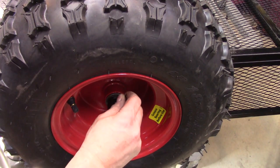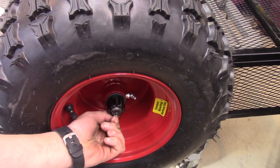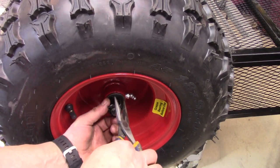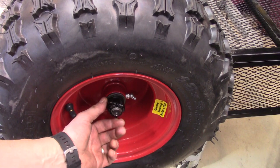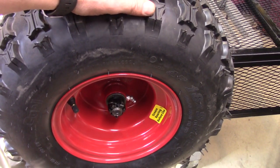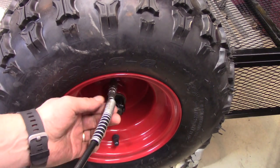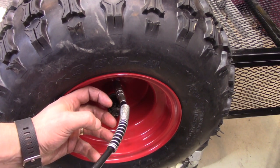Let's pop the cotter pin up through — this is the underside. Thanks for watching. This U-Trax cart seems like it's going to be pretty nice. I may go with a ball hitch and will post another video especially if I have to modify anything. I don't really like the hitch pin setup — I do have ball hitches for my four-wheeler and lawnmower and think it would work better — but for now I may just haul it around with the hitch pin to show how it works. Going to throw some grease in here — just keep hitting it until you see it squeezing out, then you know you have enough.